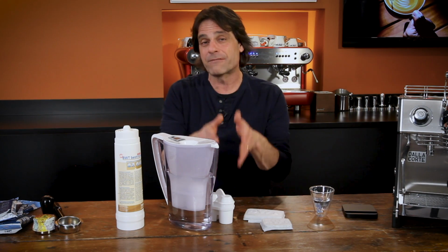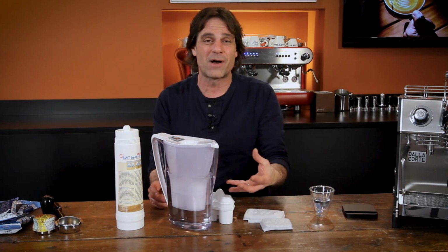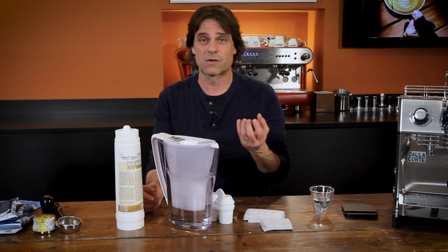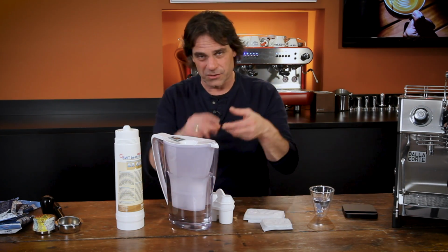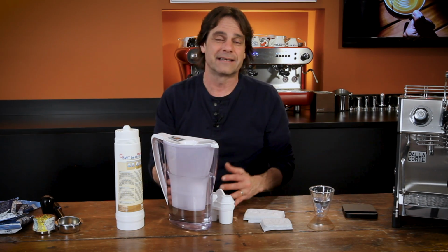So you'll never see reverse osmosis or distilled water carried in metal piping or containers. The reason why? It's such a good solvent, it can pull things out of the metal and cause corrosion. In fact, we've had boilers come back from people who've done that to our repair facility, and you'll see corrosion around where components thread into a boiler and stuff, and then they start leaking. So stay away from that. One other thing I want to mention about water.